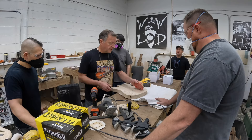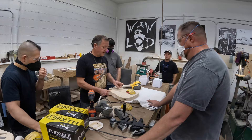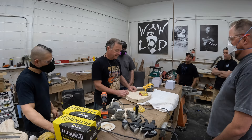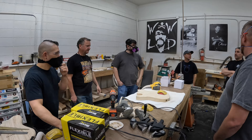Get to the 150, then you can do it by hand with the paper in your hand, and then we'll do 220 on the sides, and then we'll do 220 on the back and the top with the orbital right at the end. The reason I don't want to do 220 and then do the sides is because you'll scratch all this up with the 150. This should just take you guys about 25 minutes to do, but you have two hours. So everybody has to be done by three — if it doesn't take you until three, don't keep sanding until three.